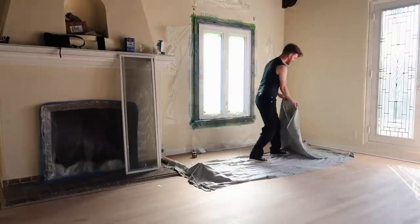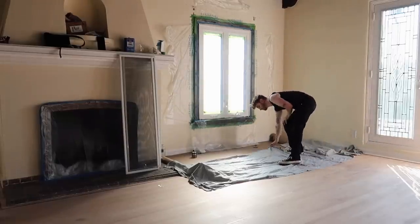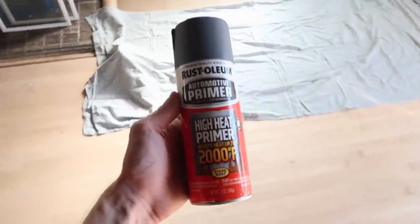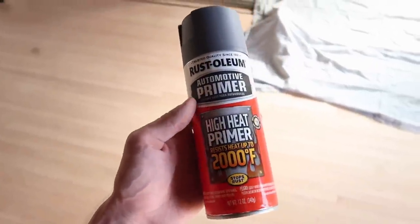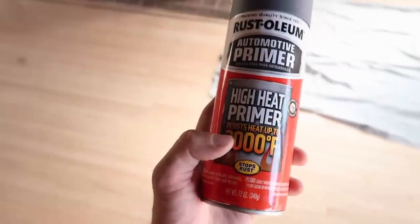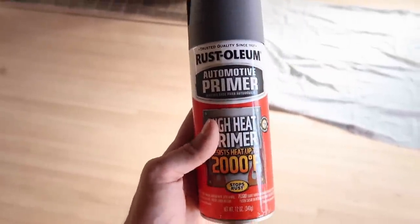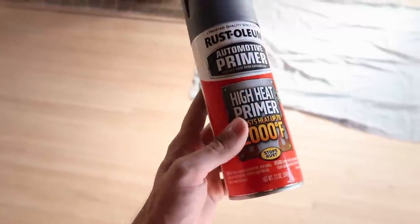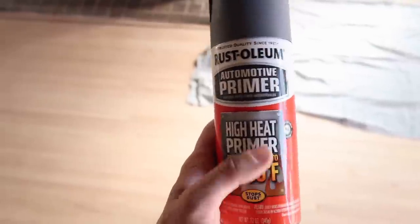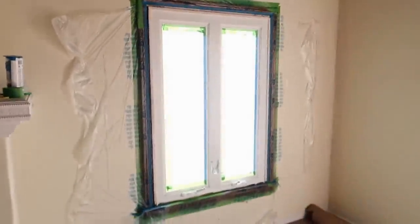I just want a little extra ground protection just in case there's any overspray — I don't want it to get all over the wrong area. Our first window is taped off and ready to be painted. We're going to go in with a primer to start. This is the Rust-Oleum Automotive Primer — I got this at Lowe's. I picked this one because it is great for high heat, and because these are windows and they're going to be a darker color, they can attract heat, which is the main concern with vinyl windows warping. This particular product is a high heat primer meant for resisting up to 2,000 degrees Fahrenheit. We're going to start off with this, give it a good coat all over the window, and then go into our color. I'm also opening up both doors just to ventilate and clear it up.